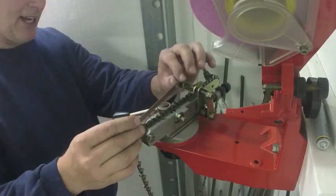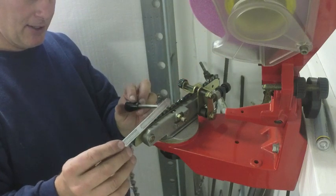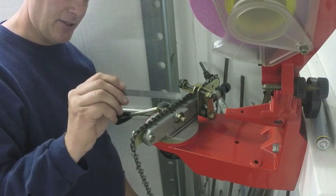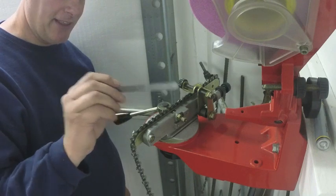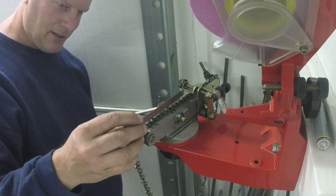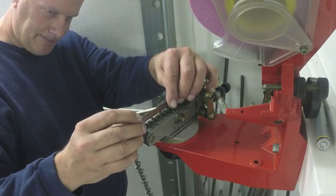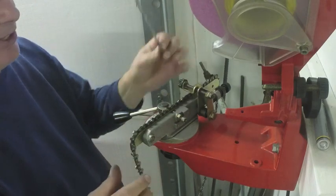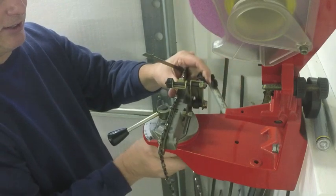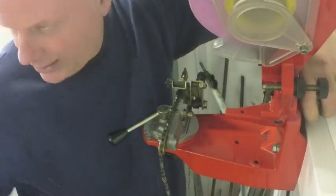They feel pretty good. You put this on your chain — you want to see that this little part of the cutter here is ten thousandths below that part of the cutter. That, that, and that need to be below the others. Those are what you call your depth gauge. It looks like we cut down a little bit, so what I'll do is put a flat wheel on here, straighten this up to 90 degrees, turn this to 90 degrees with the wider wheel on it.